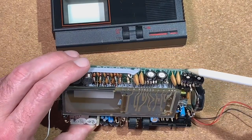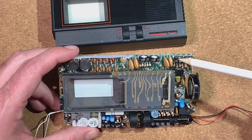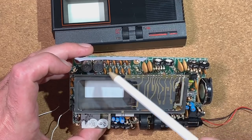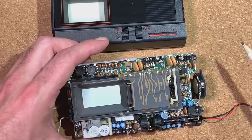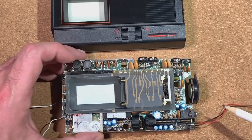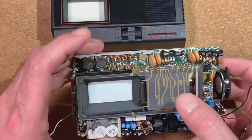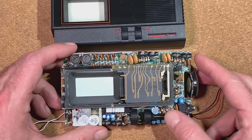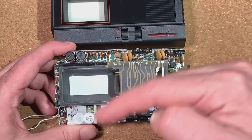What else can we see here? We have some regulators for maintaining image quality — sharpness, brightness, contrast, and so on. On the side there is a small speaker, and here the circuitry which creates the high voltage for the anode. I can tell you from experience: if this thing is powered up and you touch it, it's going to bite you really hard. If you want to learn more about the functional principle of this tube and television set, just go to EEVblog — they've explained everything about this special tube very nicely. I'll put a link below.